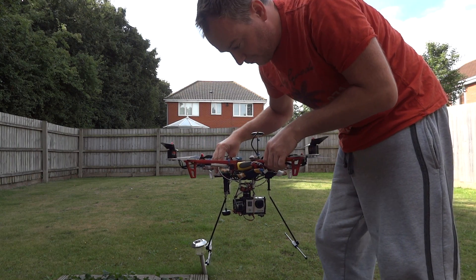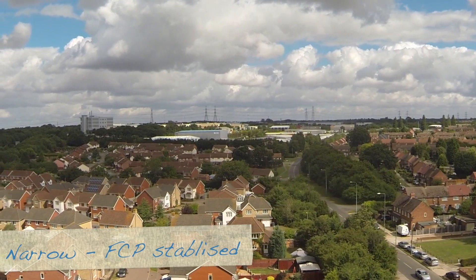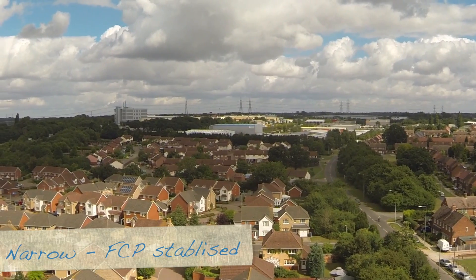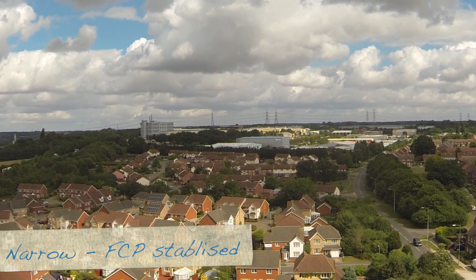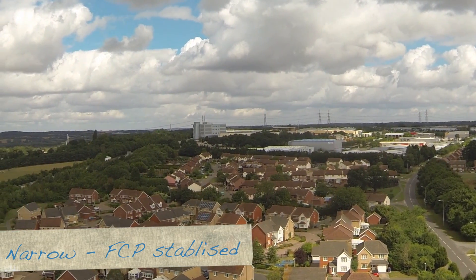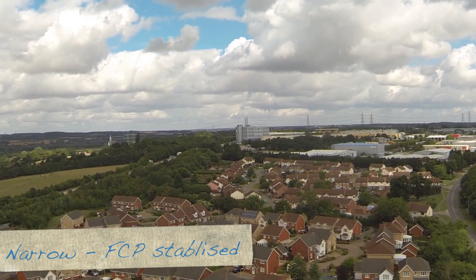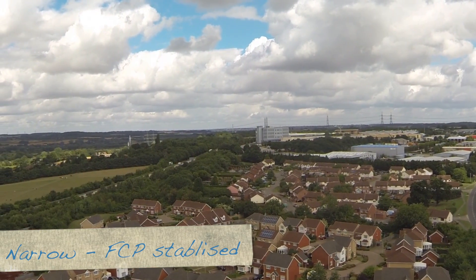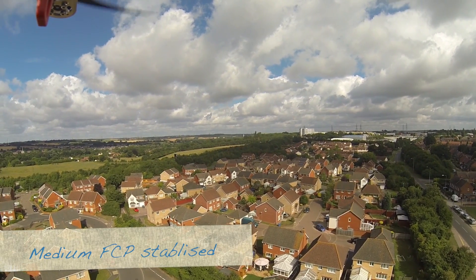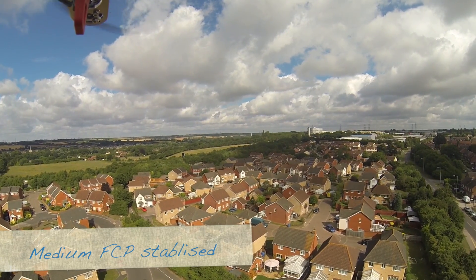Let's take it for a flight. Okay, narrow mode — it's really unforgiving and it was still showing a little bit of jitter, so I've stabilised it. Now the jitter seems to not be coming from my gimbal but from something else, but it's not jello because you can see the stabilisation is taking it out. There's a little bit of jitter somewhere, and rather than post it with the jitter I've taken it off. I taped the third axis and switched it off and was still getting a jitter, so I'm showing you it stabilised.